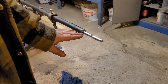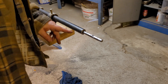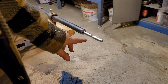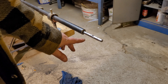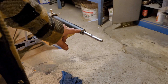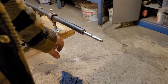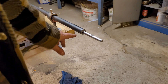Now I will check how deep I did the cut. I'll pry out the cutter, clean it, and then we'll see how deep we've cut so far. Last time we had a groove depth of about 0.2 to 0.25 millimeters. Now I'm aiming for 0.3 millimeters, and I think this was the last round.